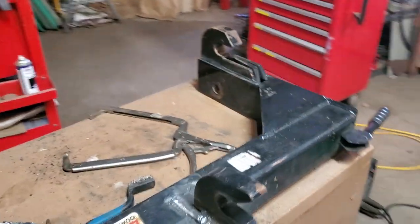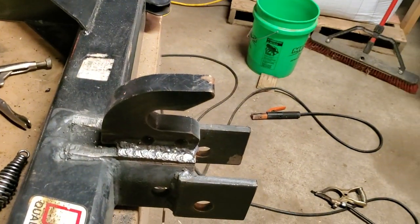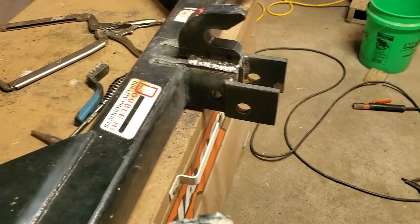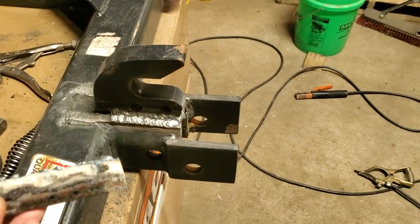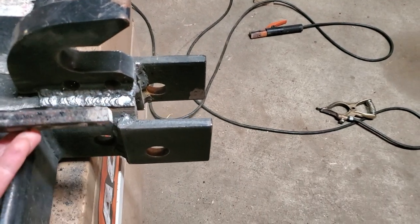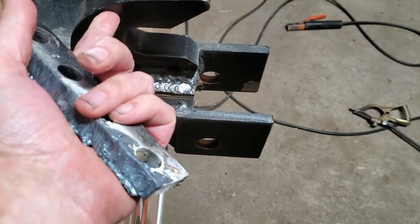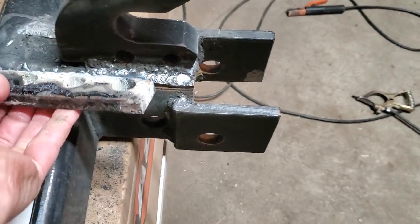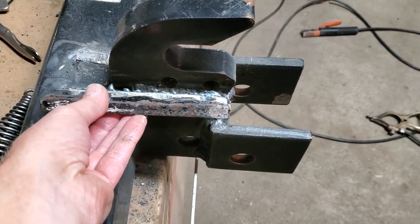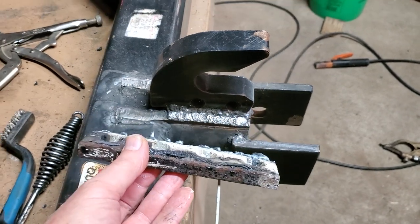Time for a shop video — this one turned out pretty well. The problem I was having: this is a quick hitch that goes on the back of one of the three-point hitches on the tractor. It came as an aftermarket one, supposedly adjustable so the top hook could go up or down depending on whether it's category 2 or category 3. All my implements are category 3, but the actual tractor is category 2.